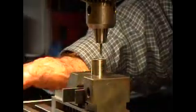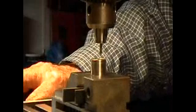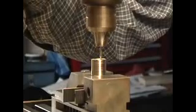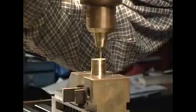Here I've indicated 0.25" away from the center of the billet. The tip is now mounted on my mill, and with a number one countersink for the smaller hole. We've changed to a number 31 drill — it was a number 13 last time, so that's a bit of a coincidence, but nevertheless, there we go.